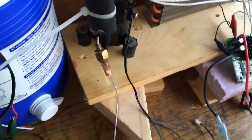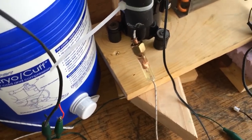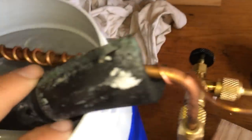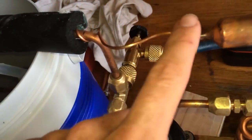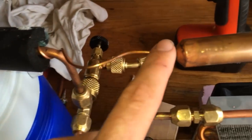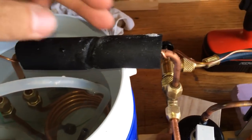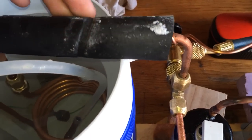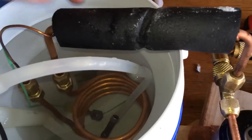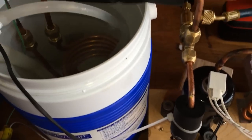This reading was taken on the exterior of the copper. I've found in the past that taking the internal reading — which I could do with the equipment I have — would show probably less superheat. It shows the heat interchanger working, not because I was really trying to do anything fancy. It's very practical — I want to be able to remove some heat from the high-pressure side going into this capillary tube. It is effective: the capillary tube side is warm and the suction line side is quite cool, meaning I'm giving up heat to the suction line. There's not really a huge advantage other than increasing the overall cooling capacity. The main advantage is ensuring I'm not getting any liquid slugging back into the compressor — it just warms those gases a little bit and tries to keep that superheat value in a positive range.